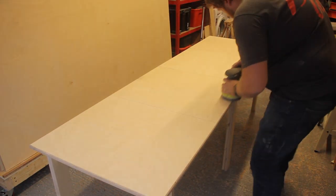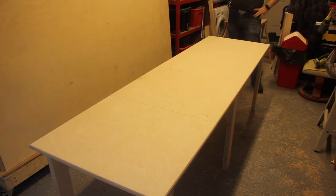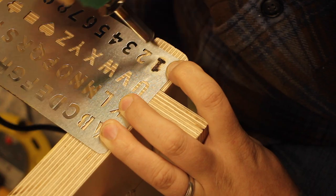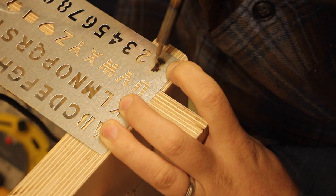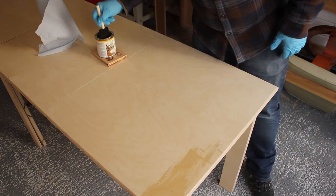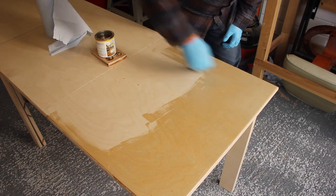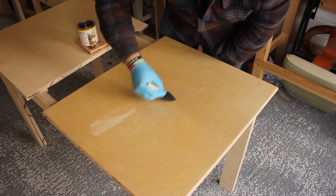I went back over with 120 grit just to knock out any spots made while moving it around or when I cut it into four sections. You also have to have the Instagram inception — I'm talking to you while he's talking to them, which could be you. Nearly finished — just need to burn in some numbers so you can tell how to put it together: one, two, three, four, all the way around, so everyone knows where everything is meant to go. Then time for finish — I only did the top, not the legs, as they won't be on show. Back to old faithful: Osmo Poly-X oil. It's a lovely product, amazing — yes, it's expensive, but it does the job really really well. I coated top and sides.